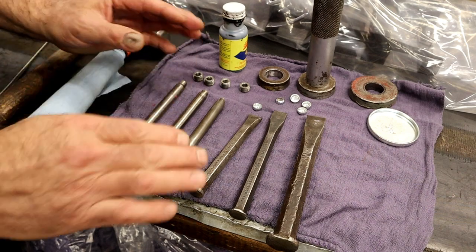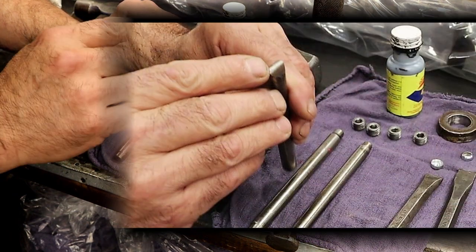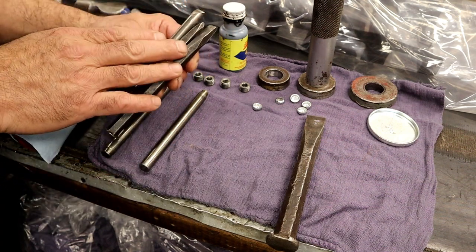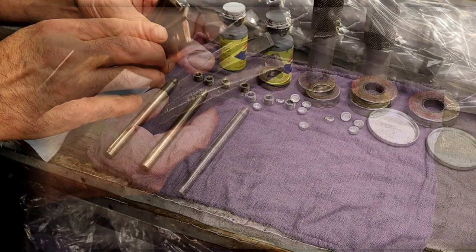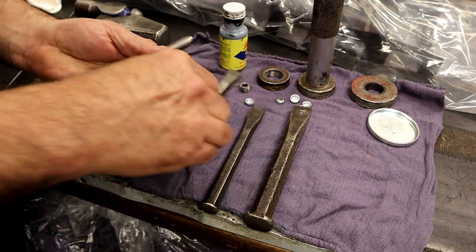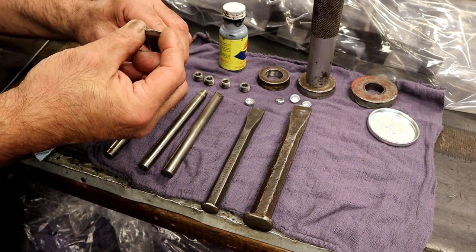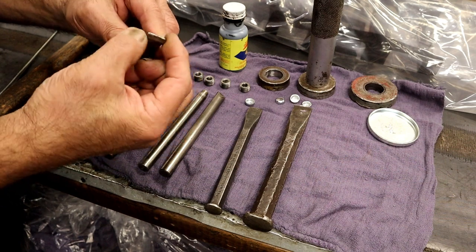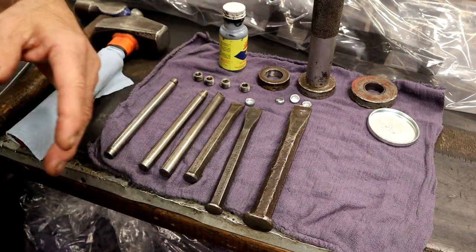I have different ones. If you can see the ends of these chisels — these chisels don't go in the chisel box. These chisels stay in the area of assembly. They look like chisels and they are chisels. What's the difference? I've rounded all the ends — they're no longer sharp. These stay just in assembly; these are the ones I do the swaging with. I have different ones to copy the factory ones. Since they're rounded and not real sharp anymore, they're actually going to swage the end and move metal. We want to move metal. We don't want to put a chisel mark on it.